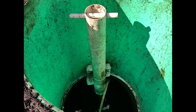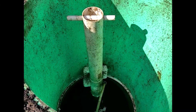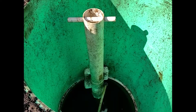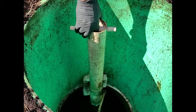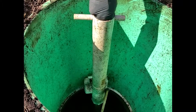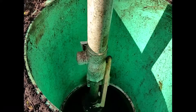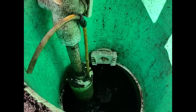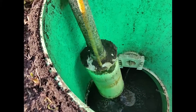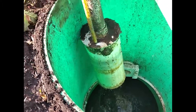We are going to pull the Mode 3 Advantex system AX20 unit. We are going to pull the recirculating splitter valve which is a duckbill. My helper here is going to pull that all the way out and then you can kind of see down there where that slides into, and you can see the cage is a little dirty so we are going to spray that off.